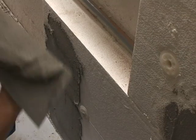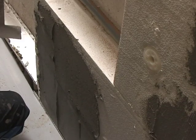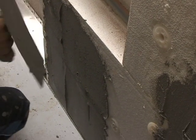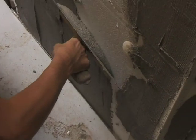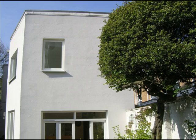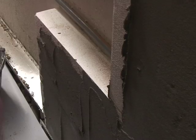There can be planning issues when you do external insulation because you change the look of the property. In this case the look did not change, and we chose it only for the back and sides of the house — not the front, where the Victorian details absolutely should not be obscured. Each case will be different, but you have to think carefully about the planning issues.